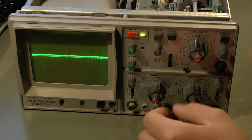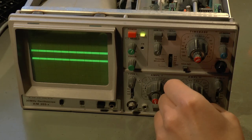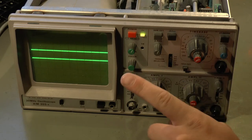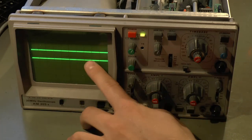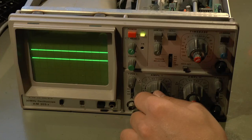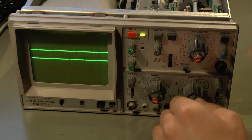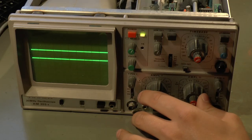Y position still works fine, X position still works fine as well. Switching to channel two: the Y position is completely off. Interestingly, adjusting the fine zoom control changes things but the coarse zoom control does not. If we put on both channels at the same time — moving one up and one down — you can see that these things are being affected independently of one another. That would actually speak for something happening on the front end.